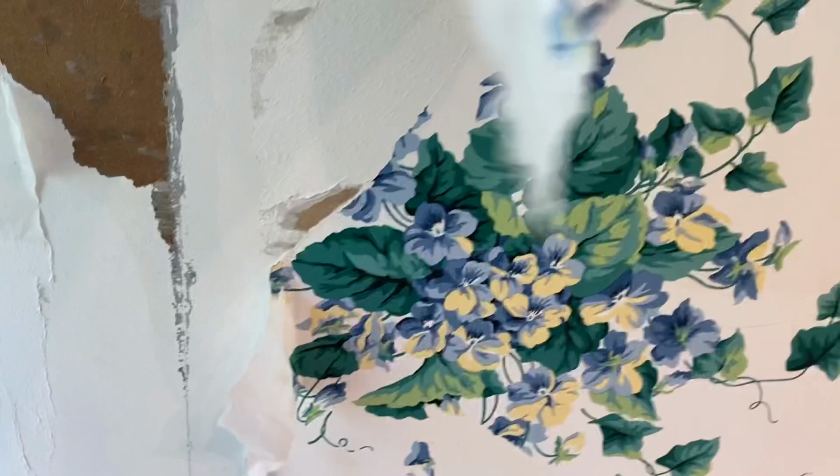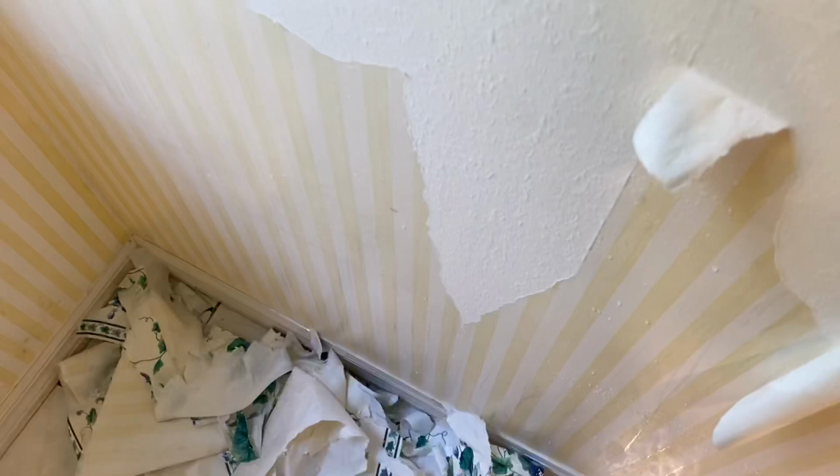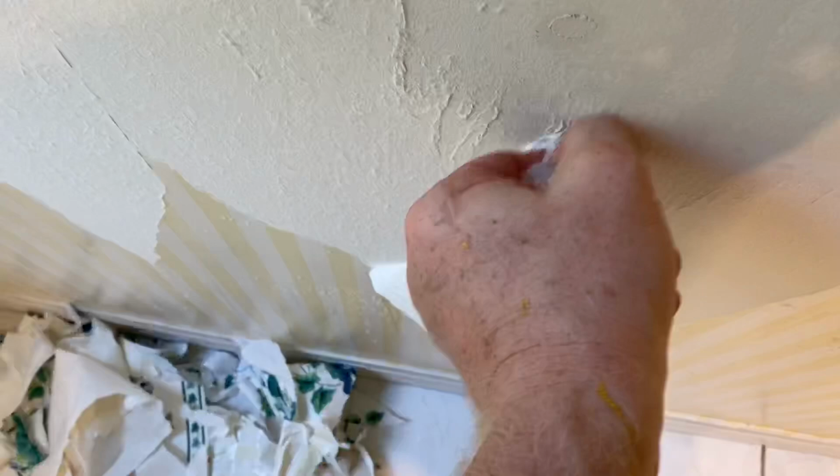That's essentially how to remove wallpaper. Okay? You remove it with water, and then you determine what comes down easy and what doesn't. And the whole trick is water and patience. Don't start taking metal scrapers to this stuff because it's not coming down easily. Go right to your water and use the water to get it off of the wall. Okay? Because you can see how the difficulty is exaggerated due to the lack of water. Okay? Water is your friend in this case.